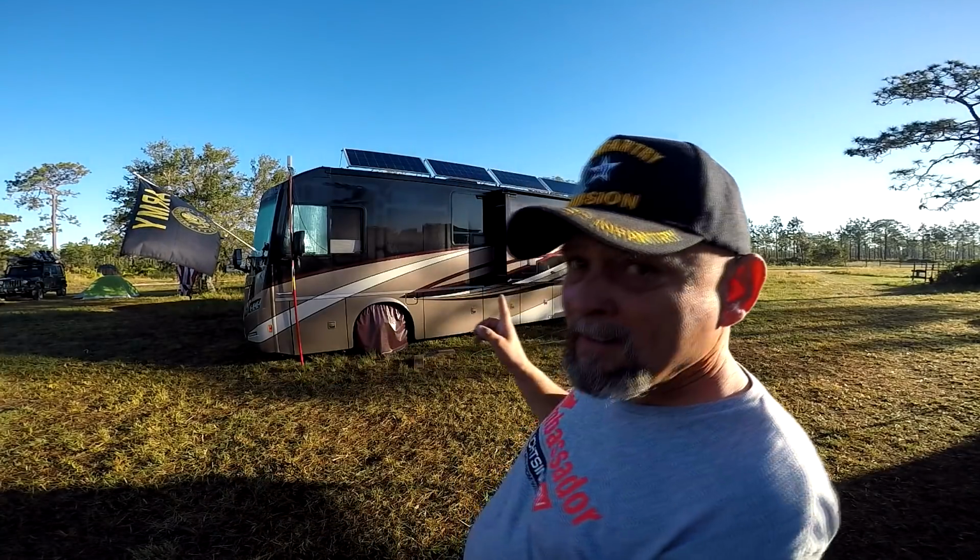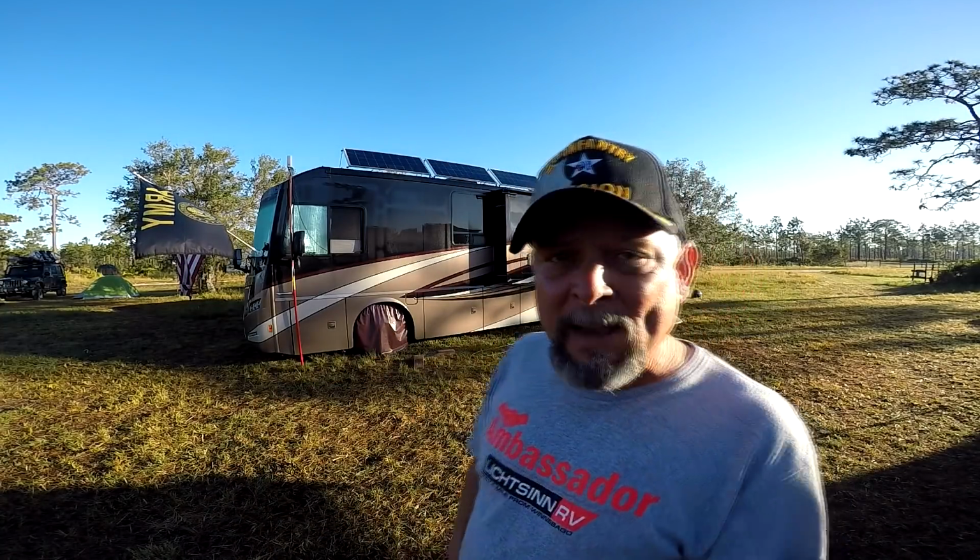Now, solar power, as I showed you before, if the auto gen start system was in quiet on, it will start the generator at 8 p.m. and run till 10 p.m. so that we can go all night and the generator doesn't have to start again before 8 a.m. in the morning. But if we wake up with full sun, like we have this morning, and the sun gets up there on the panels, then we don't have to run the generator in the morning to charge the battery bank. The solar takes over and it charges it throughout the day.